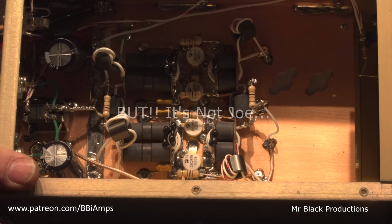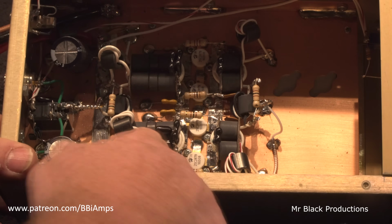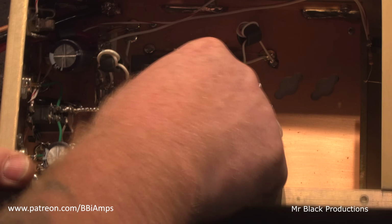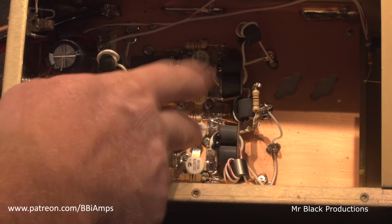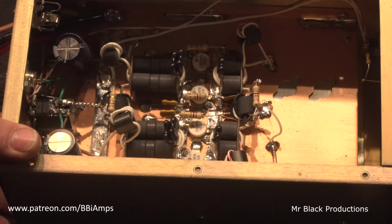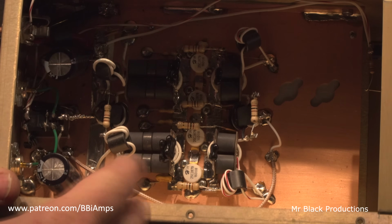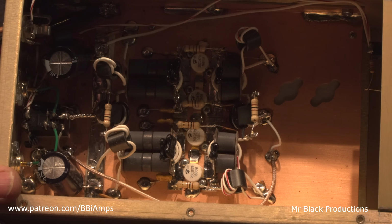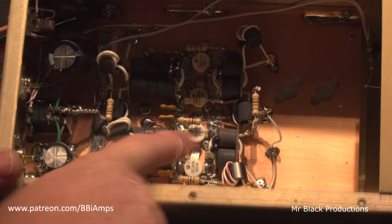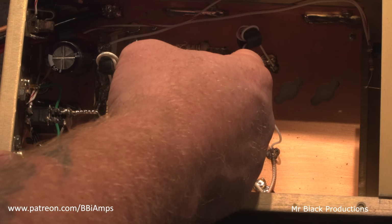Output relay is a little bit smaller than what I like to use, me personally. Combiners look okay. So what we got for output capacitance? Oh, let's see here. Two 500 puffers. So something happened in the last year or so, and we had to change our output capacitance based upon the transistor because the 16D08 changed. It just changed. So this is not right. He's got 1,000 puff on the inputs.